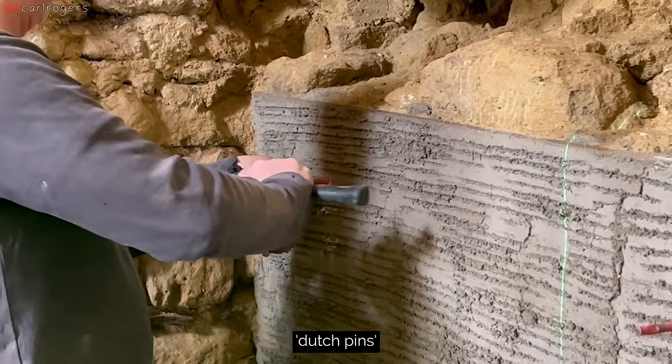Once I had them all roughly the same width, I went through checking for best faces and also to see which ones were bowed, which was about half. Then I cut them roughly to length, making sure I kept the nicest run of each joist, and marked the bows up for later.